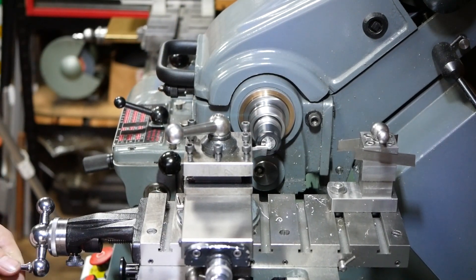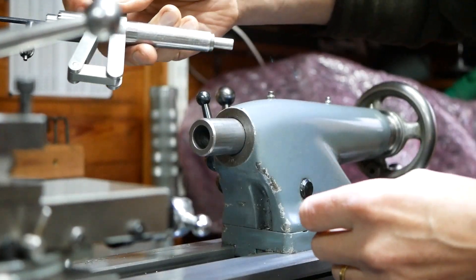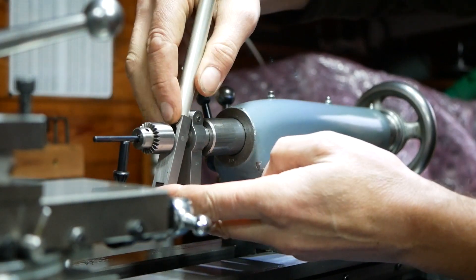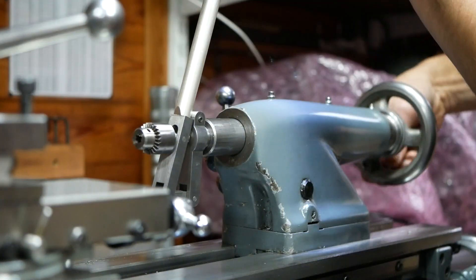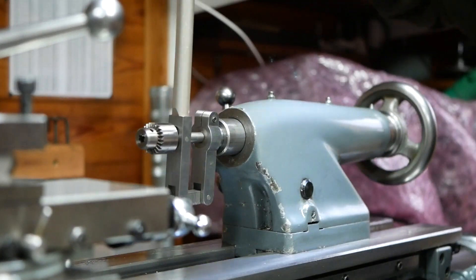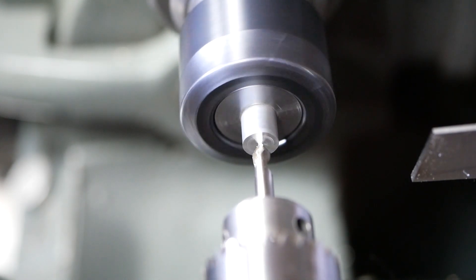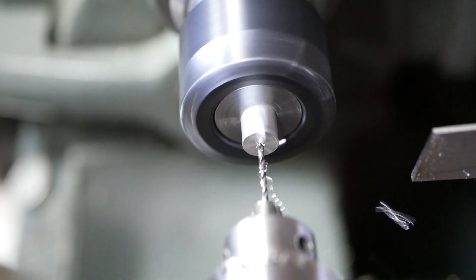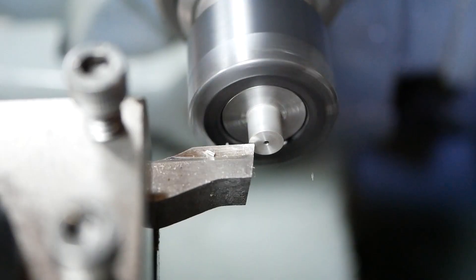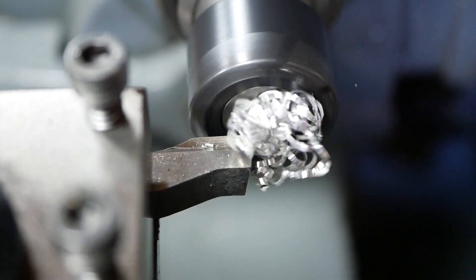With the right motor the Super 7 is capable of spindle speeds of up to 3000 rpm. A sensitive lever-style attachment in the tail stock makes it easy to drill small holes. The attachment you see here is shop built and makes for a fun project but it can also be purchased. Even without the sensitive attachment the tail stock hand wheel provides ample sensitivity for drills down to around 0.5mm, but I would recommend a sensitive drilling attachment for holes less than 1mm.